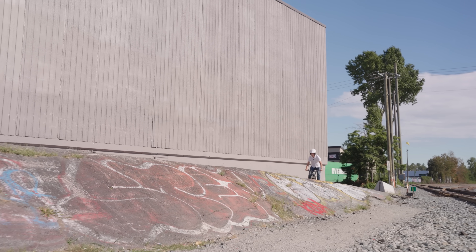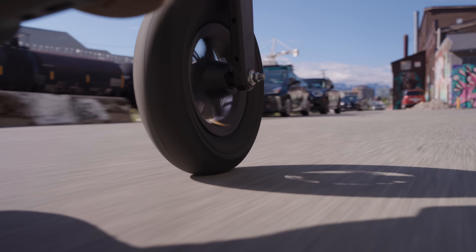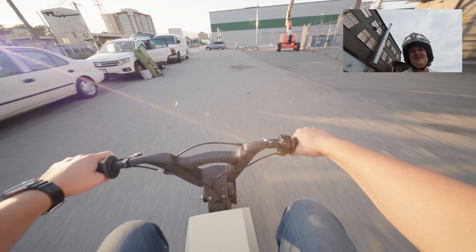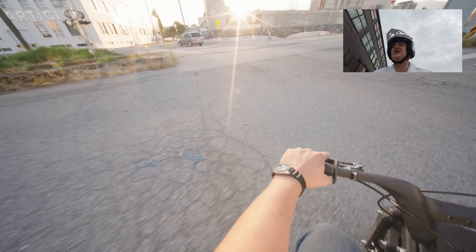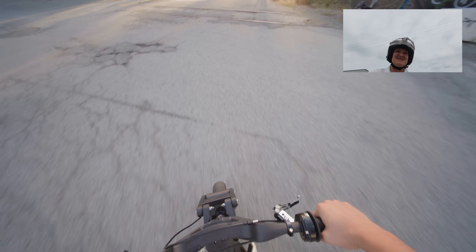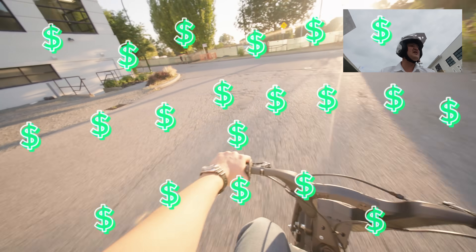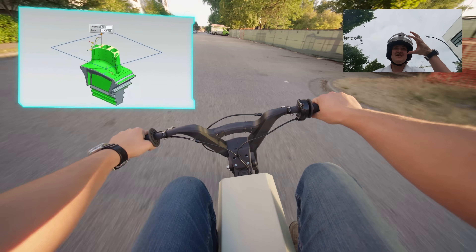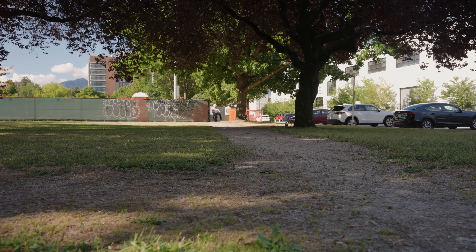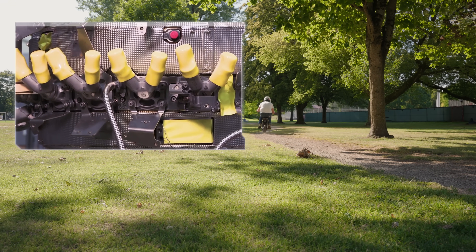Affordability is crucial — it's a crisis. The kids around here have 90% of their salary going towards rent and groceries, so even a $5,000 Honda isn't going to happen. But 3D printing brings a whole new breed of cost optimization. Take a fuel nozzle — it has lots of interior channels and passageways that can't be cast or injection molded because they're too intricate internally, so they're typically made from up to 20 smaller parts. With additive manufacturing you can make it cheaply in one solid piece, as General Electric did with their fuel nozzles in their LEAP engines. If you've ever flown on a 737, you've soared on the wings of 3D printed affordability.